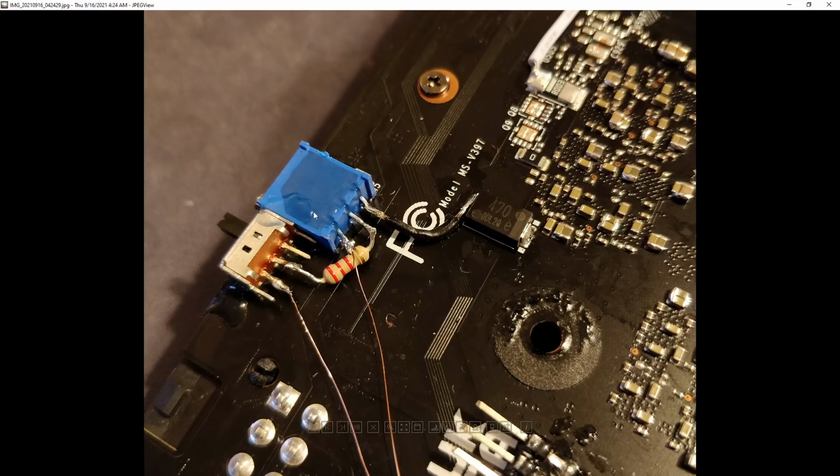I believe the lower, actually, this doesn't have a lower voltage limit, which is a bit awkward. I could potentially set the memory voltage to like 0.5 volts or something stupid like that, but the memory doesn't really work below 1.2 volts anyway. If you start pushing it significantly below 1.2 volts, it starts having all kinds of issues. So, yeah, there's not really any reason to that.